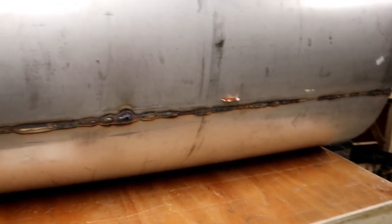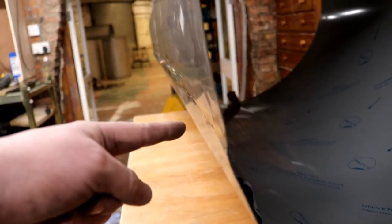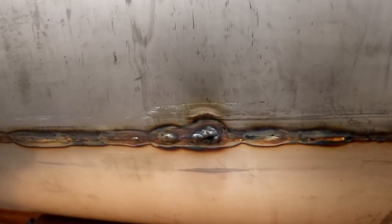Second tank complete — had an absolute mare. Massive massive blowout. It looks terrible. Most of it's good though, it'll clean up. I put an extra 5 amps into it and got better penetration. If you look down the length of it, apart from a little distortion from the rolling, it's pretty good — the inside's pretty good too, so I'm chuffed. The blowout was probably because of the extra 5 amps — I wasn't moving fast enough. Technique: don't rush. But that's two done.